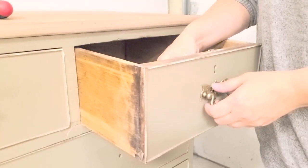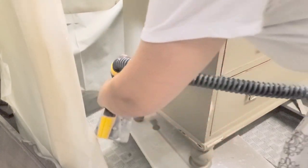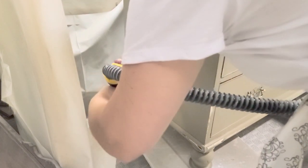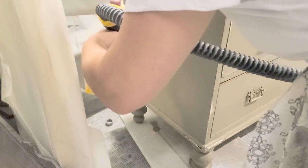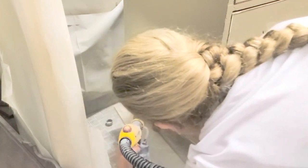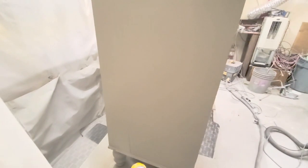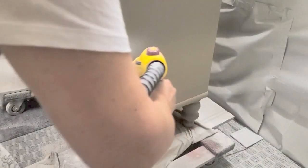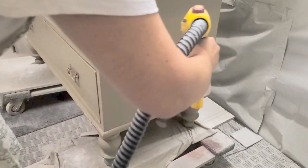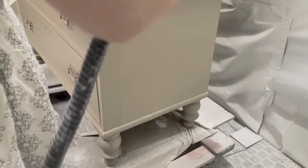As I was spraying the front and sides I realized I wasn't too keen on the cracks running up the sides — there's one on each side. So I filled them in with DAP wood filler, then primed, sanded, primed again, and sprayed the paint color over it. With the solid color on the sides it just didn't look right — at first I thought it went with the aged, vintage feel, but in the end I covered it all up and repainted and re-top coated. You can still see it slightly in the end, but not too much. It also gave a little texture to the front which I actually kind of liked — it gave it character and a new look.